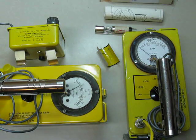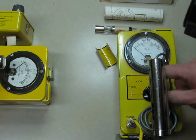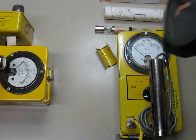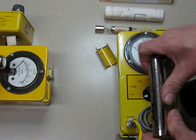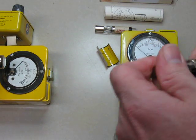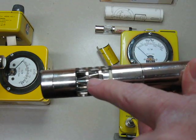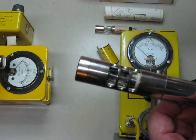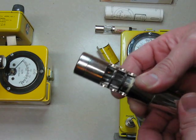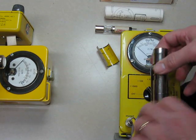I'm going to take that off and push this to the side. This extended range unit is on the x100 scale here with the Eon tube in it. I'll show you the tube and how it looks inside the probe. You can see it in there - see the cage and the small little detector element. This tube is so much smaller; the detecting volume is greatly reduced, so it in fact extends the range by 10.